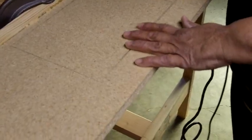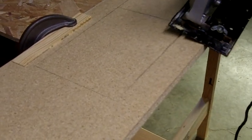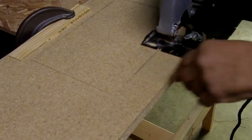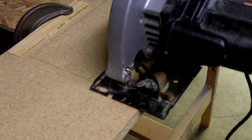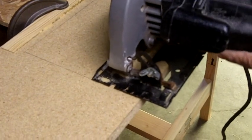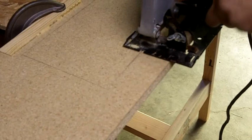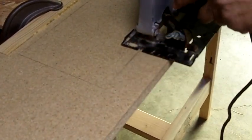Now I'm going to go back in the other direction. This is a little different because we don't have to repeat the plunge cut — we can just start the saw inside the cut itself. Just make certain that you're not up against the surface you're going to cut because you don't want the circular saw to jump. Give yourself a little space and continue down to the line.